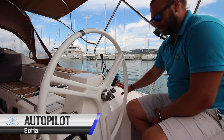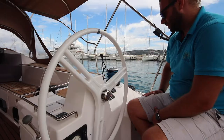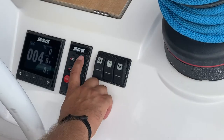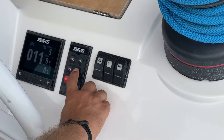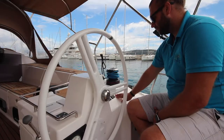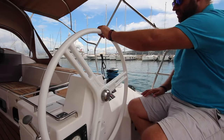The autopilot is located on the starboard helm station. To engage the autopilot, click auto and it will hold your current heading. To increase your bearing to starboard, press plus 10 and you will turn to starboard. Or if you don't want to adjust by that much, adjust with single degrees. To turn to port, hit port. To take the helm manually, press standby and then you can helm manually.